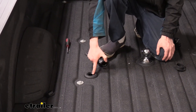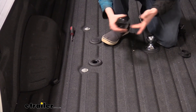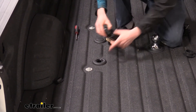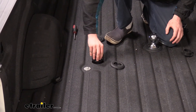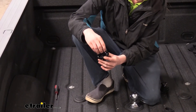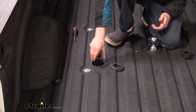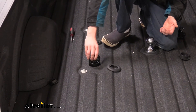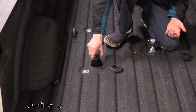Our safety chain anchors will attach to the pucks located on each side. In most cases, you are going to have to remove the ring — I've found that regardless of what brand it is, they all seem to not drop down far enough when the aesthetic ring is in place. We'll go ahead and try just to see — and yeah, it won't turn; it holds it up just high enough to where it's not going to work with that on. I am lifting up on the center section here. You don't need to lift it when just dropping it down, but in order to twist and lock it into place, you will have to hold it up just a little bit. You can sometimes get lucky and drop it and just twist and it'll go, but sometimes it does get hung up — it just depends. Once it falls down in there, that is the locked position; it can't come up.